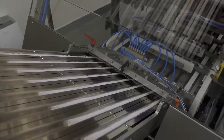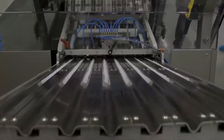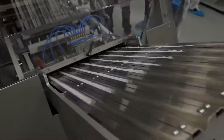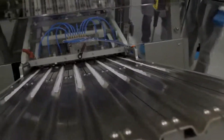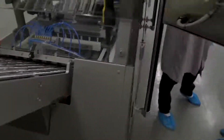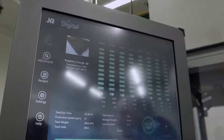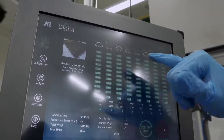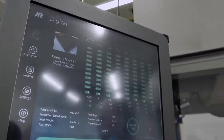You can see the detail and precision — the cannabis is loaded in, Scott will load the cannabis in. It goes through and weighs in these little buckets inside there. As it weighs, it hits those scale targets so every single pre-roll is weighed individually and it hits within tolerance. Scott sets the tolerance to weigh within 5%, and when it hits the tolerance it puts it in the cone, packs it, and weighs that exact amount at the other end.